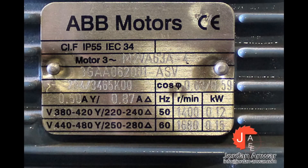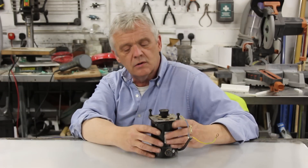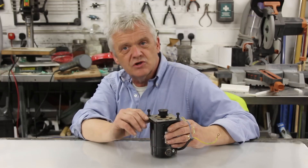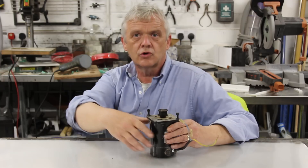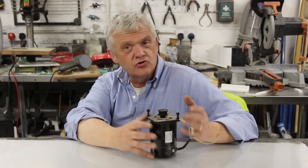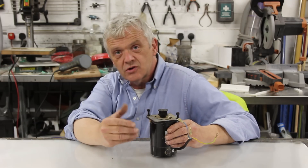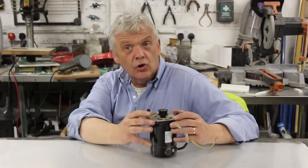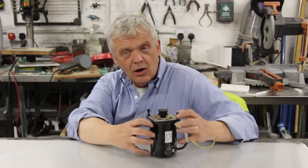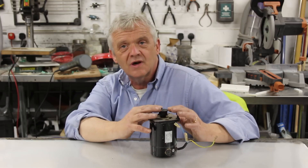Usually if you have a motor, you can look up its specifications, and those tell you everything you need to know about how it will perform. When this motor was wound, it was wound with a specific gauge of wire because it's a physical thing — we can only get so much wire in there. The thicker the gauge, the more amps it can cope with; the thinner the gauge, the less amps but the more volts we can put in. On these high voltage motors — and 230 volts is pretty high — the coil in here will be relatively thin and can't handle a great deal of amps. If I try to put more amps in by upping the voltage, I will burn out the coil. So there's a physical limit in terms of construction of how much I can put in here to get it to turn.